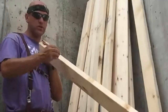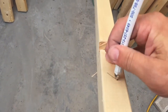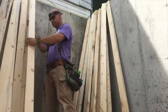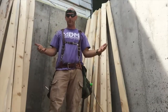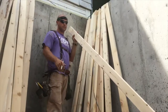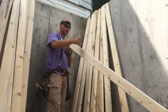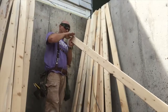So we are going to make an X on the side that has the crown. That is crowning studs. We are then going to set them aside and they're marked for later use. So we have all these studs that we're going to crown so we can use them. That's my crown — just confirming. The dip is here, that means the crown is here.